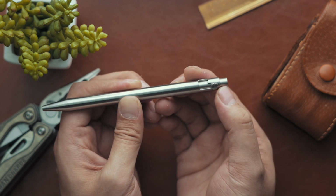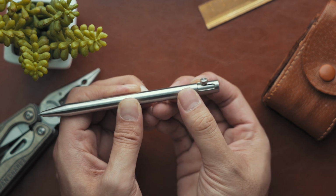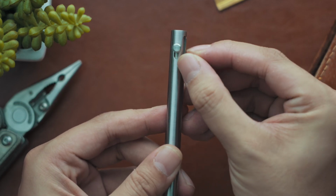Bolt action. Why? A bolt action mechanism is super reliable and uses minimum moving or breakable parts. You can totally lose the cap of a basic pen, and a standard clicker pen has teeth that grab onto the internals, and if you drop it enough times or at the right angle, that entire clicking mechanism can break and your pen is rendered useless.